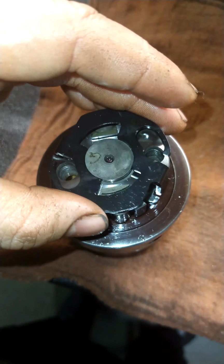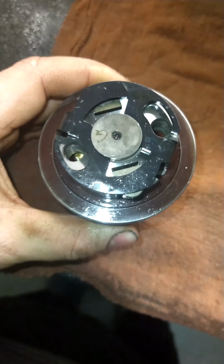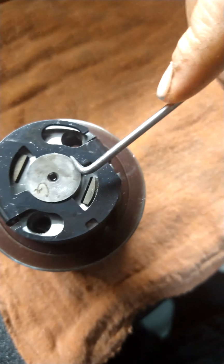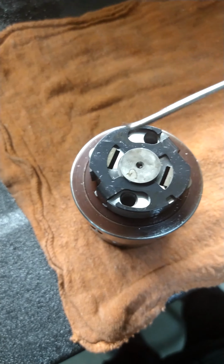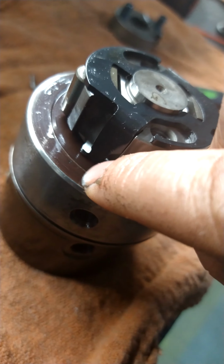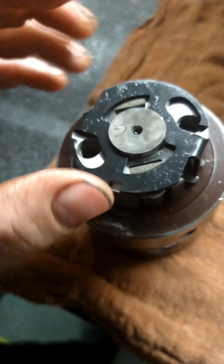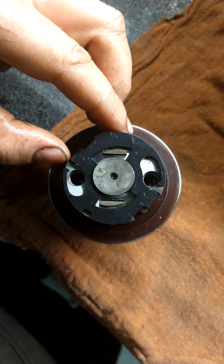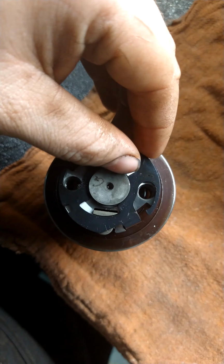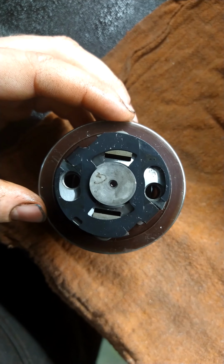you install this plate. Now this is what actually adjusts your fuel setting. So you can move these things all the way out. So you can see, oh, let me turn this light off here. Those are pushed all the way out right now, because it's at its max fuel setting. That's because this little plate has to ride in that little slot on both sides here, and that's what actually turns the ring at the bottom of the cam follower, and that allows movement for how far it can go out. So if I turn this ring all the way in like this, you can see it does not allow those followers to go out near as far. So this would be your minimum fuel setting, and then here is your maximum, because it allows those to go out so much further.